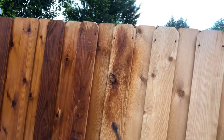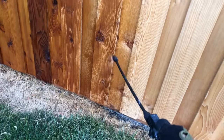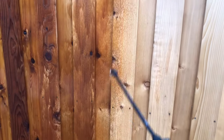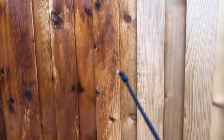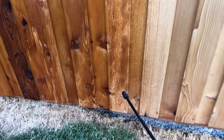Next was a pump sprayer. The nozzle on my sprayer is not the greatest, so if you have a better one, your experience might be a little different. It definitely worked for getting the stain on the wood. They say there's no backbrushing required — you can just spray it on and let it drip down and even out. I ended up going back over it with a roller and a brush. You could absolutely do it with only a pump sprayer without backbrushing, but you would probably end up using about two times the amount of stain.